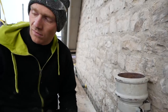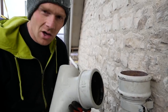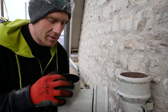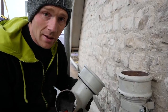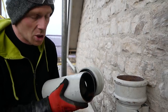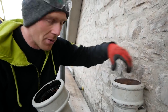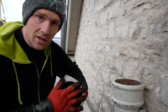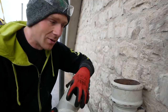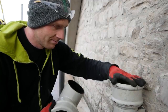For that reason I went for the push-fit system, which is cast iron — it's a Hargreaves Foundry item. Yes, it's expensive, but it's got a 2K finish on it, so if you're happy with black, or if you've bought a load of it, you can get it made to the right colour. This should be okay to fit in here the same way — we'll put the rope in, we'll put the sealant in, and then from this point onwards we can go to our plastic pipe. From the other way, we've got another socket to go on and we can go back to our last section of original to vent to the top.